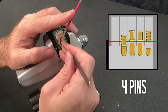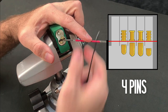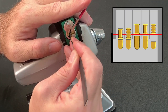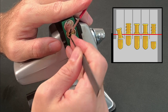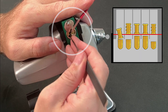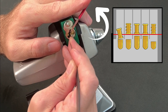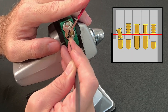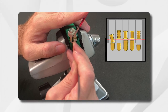Finally, it was time to add the last pin back in — the moment of truth. Could I pick a fully pinned 1100? This time, for the first time since working with this lock, I fell into a deep false set after I picked the back four pins. The spool on a three cut actually allowing the security pin to operate as it was designed to do. This presented a new challenge: I had to play with counter rotation without dropping the pins I'd already set.